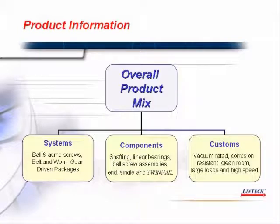Common manufacturer mounts that we have provided in the past include Allen Bradley, Kollmorgen, Parker, Yaskawa, Mitsubishi, and Emerson, to name a few. The complete start from scratch category is a design specifically geared to solve the customer requirements and may not have any standard parts incorporated into the design at all. This could include the entire frame made from aluminum or steel, special load interface brackets or plates, long travel lengths, high speeds, and heavy loads.